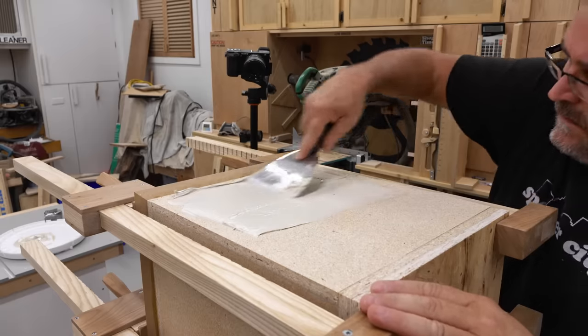I got the painting done, kind of. Even though it looks pretty good, the front baffle is not where I want it to be. But I need to finish putting the subwoofer together so I can finish the build, at least for now. What I'm doing right now is putting some fiberglass insulation in here. Traditionally you don't stuff a bass reflex box, and I'm not going to put a lot in — just a little bit. I find that it makes enough of a difference that it's worth it, and I talk about that a little more in the build article.